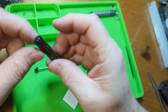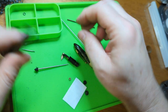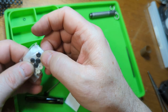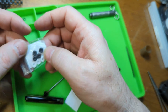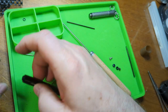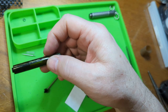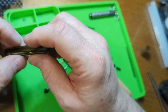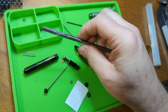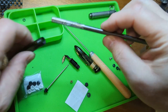This is the really, really hard part about these pens - replacing the seal on the back. Inside there's a packing that's usually made out of felt and rubber. The instructions that come with these repair kits say to replace that ancient material packing - fiber and rubber packing - with a more advanced O-ring that will last a long time. These O-rings are great, but there's no way to get it in there directly. So what you do is come in with a quarter-inch drill to drill through it, though drills can be very aggressive and you could easily go right through.